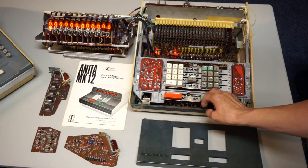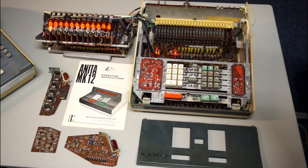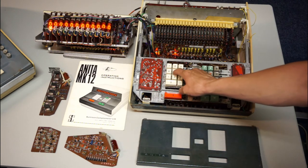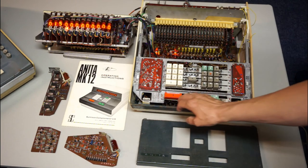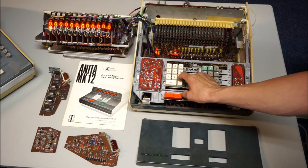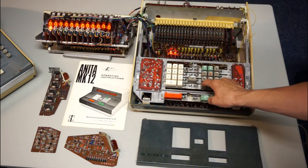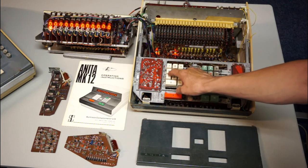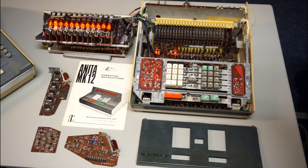When we want to multiply, we also have to add — let's say 30 in the memory — and multiply it by five, and it makes 150. You can see the number showing up directly. For division, you have to put the number you want to divide by first into memory — let's say three. You want to divide 45 by three: three is in memory, 45 is in your register, and that makes 15. That's the basics of the Mark 12 calculator.